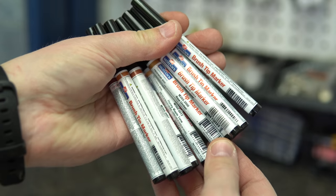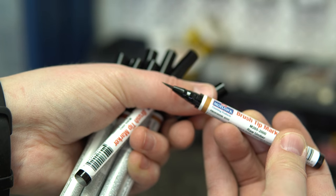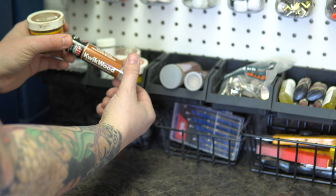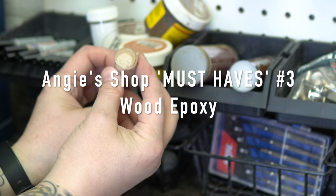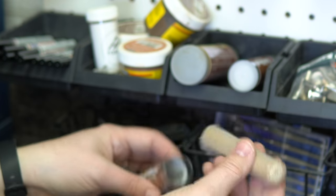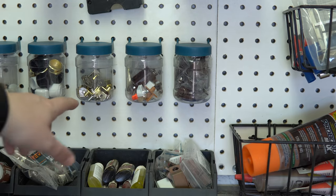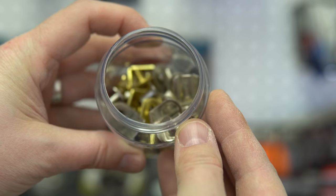I just got these Mohawk graining markers not that long ago and I love them — I love how they flow and how fine the tip is, super awesome product. I've also got various types of wood putties, great for little touch ups when not doing full refinishing. Not to be confused with this, which is wood epoxy — a two-part process where you cut off the amount you need, knead it in your fingers until it becomes one uniform color, then put it where you need it. It dries super hard and I use it quite a bit for repairing big chunks that are missing. These are shelf pins — almost every time I get a bookcase or credenza with adjustable shelves there's almost always one missing, so I save them and I also buy new ones. Guaranteed you'll need them at some point.